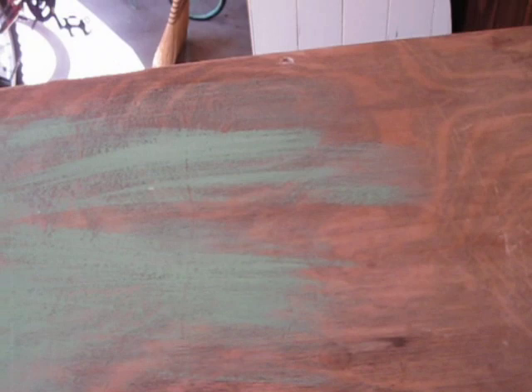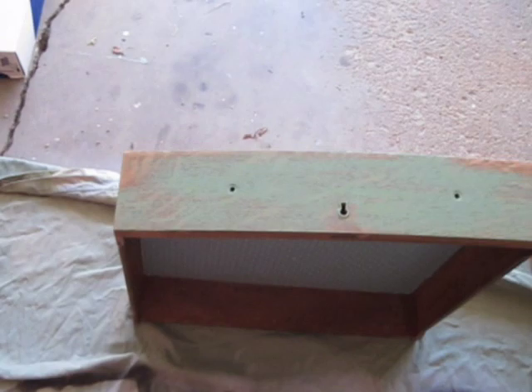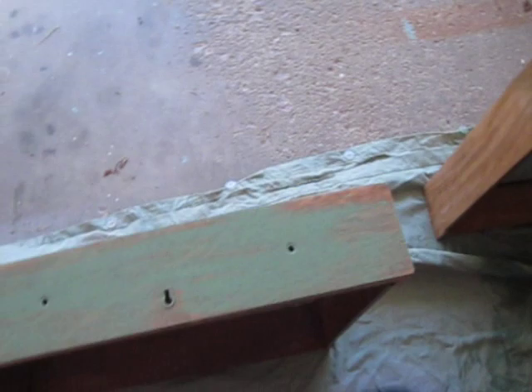There's a spot that's got more paint, but this is just the first layer. After I get the whole thing painted with one messy, sloppy coat like this - the drawer top is very rough, patches of paint thicker in some parts - I'm going to do a light sanding over all of it, and then I'm going to do this color again except I'm going to water it down a little bit and make it thinner, and do another coat.